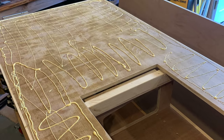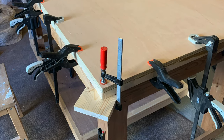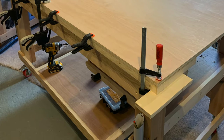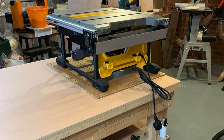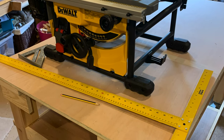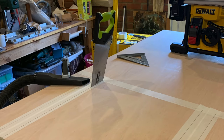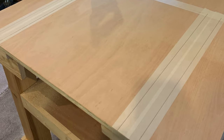First things first — I want to fix a new top, so tons of wood glue as you can see. I've clamped this all the way around and I did put some weight in the middle as well, but there's no photographs of that unfortunately. I actually left this for two days to dry. I placed the saw roughly where I wanted it to go, but now it's time to get some exact measurements. I took the table saw measurements and made sure that the table saw sat central to the bench. I decided to put down some masking tape so should I get the measurements wrong I can rip it up and start again. Now onto the brave part — time to start sawing. I always prefer to use a hand saw when I'm cutting anything like this. Well, that went surprisingly well.